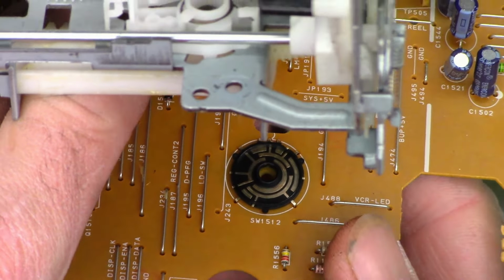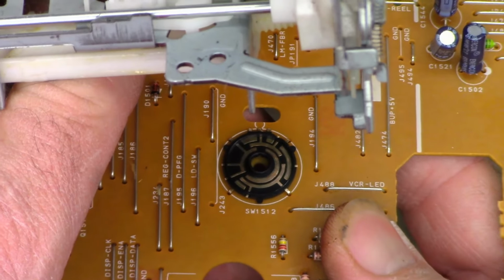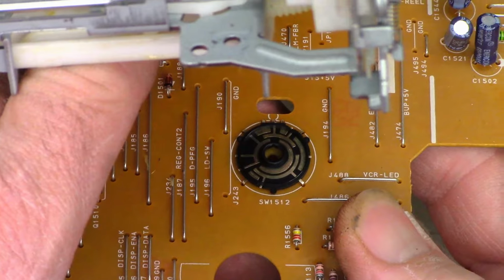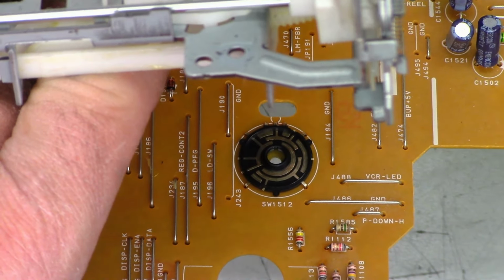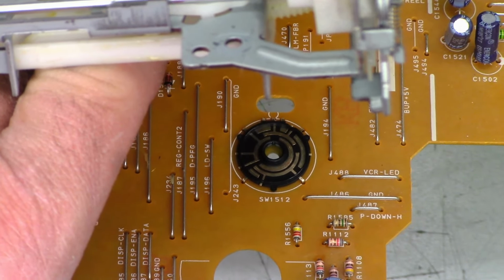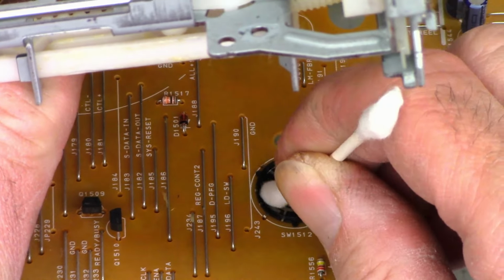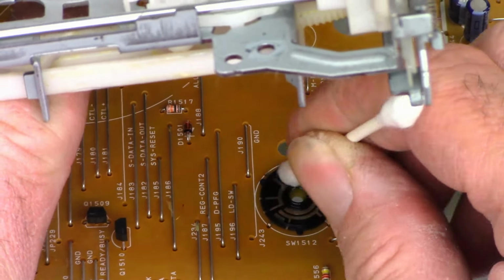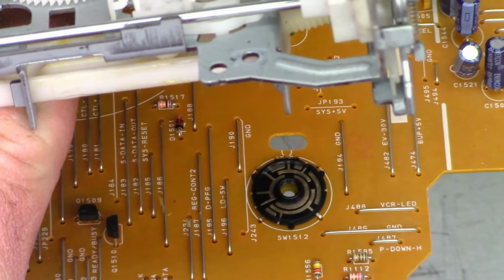And definitely, yes, it does need to be serviced. I see a bunch of oxidation, tarnish on the silver. So I will get my acetone out. I'll get my stainless toothbrush, and we'll go ahead and give this thing a quick scrub. One moment. So I just want to wipe it down with a bit of acetone first. Acetone will not hurt this switch. It does not eat the plastic that they use to manufacture this switch.